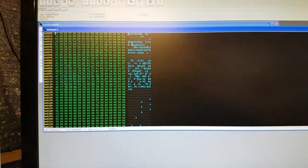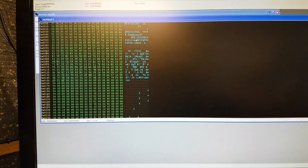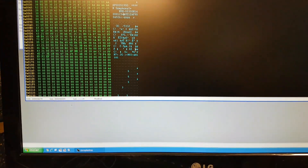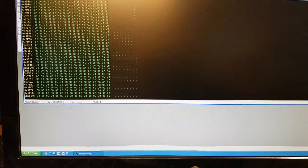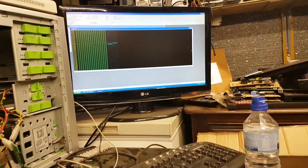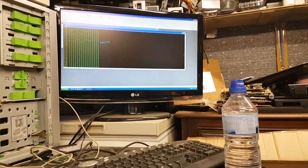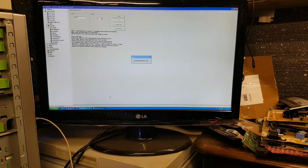I'm going to show you the data. One of the things you need to make sure is that the data makes sense. As you can see in there, there's 'Symphony 2' and there is a serial number — look at that, bingo! So everything looks okay. It's quite a long EEPROM file, although there's only data up to a certain point. I don't know the position of the code, or even if it's encrypted, because if it's encrypted that's a whole different story.